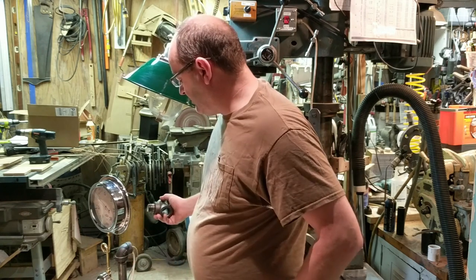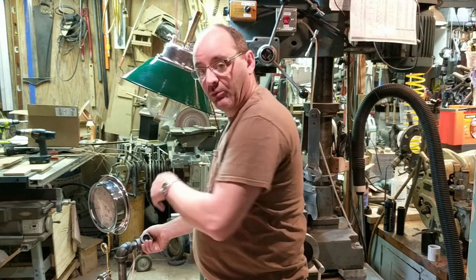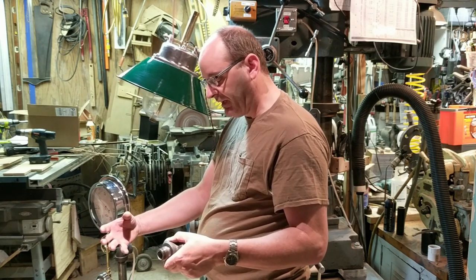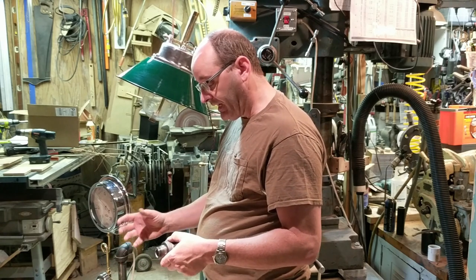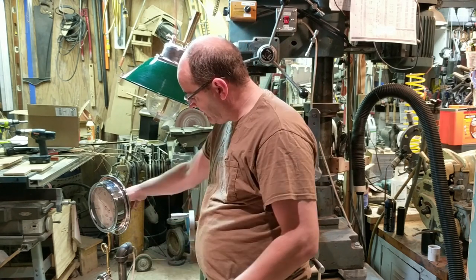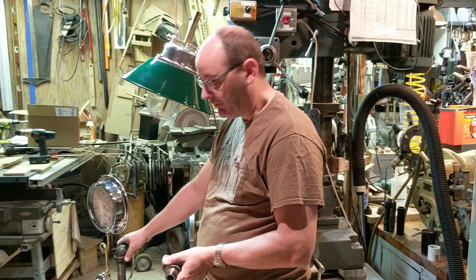My plan is to use a T fitting at this point. The brass arm will come up this end, and down this end will be a short nipple, probably something like 8 or perhaps 10 inches long, that will contain a counterweight. And that way, whatever weight is up here will be counterweighted over there, and the lamp will be stable.